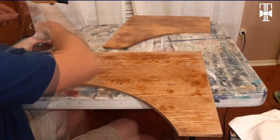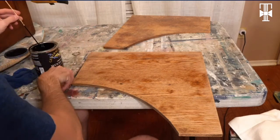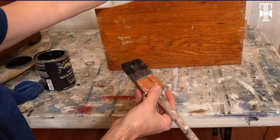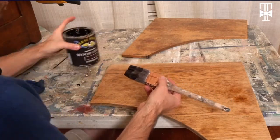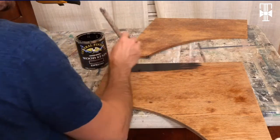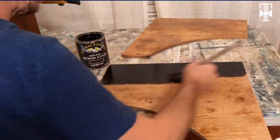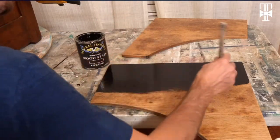I'm going to demonstrate this today. The other side is going to be underneath, so I'm not doing anything with that. With this espresso gel stain — which you can see on my Amazon page — you need to determine if you want it totally blacked out, so dark you can't see the wood grain, or if you want to see the wood grain. Normally I like to see the wood grain, but two coats will hide it completely. Some people like that to hide all the flaws.